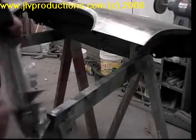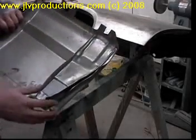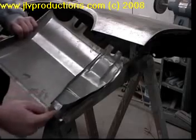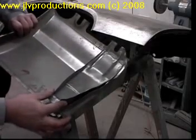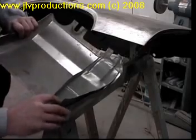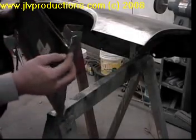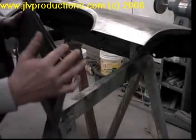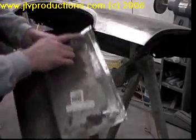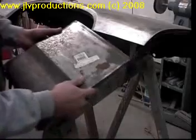And what we did is, the inner brace comes welded on the new piece usually. We took and cut down the edge on both sides and crimped the two sides in, and pushed this back. Now when we cut this here, we also open this out. I'm not worried about how any of this fits at this point. Right now I'm more interested in just being able to get this back on the fender.